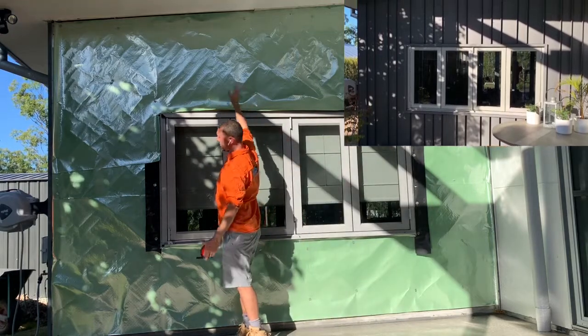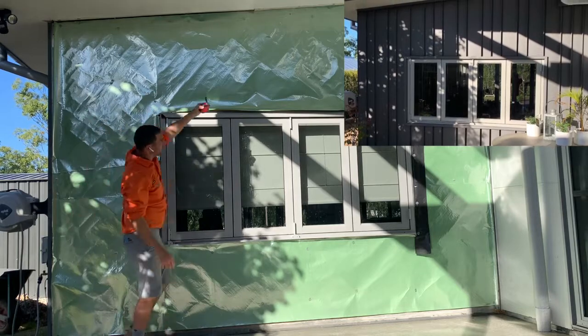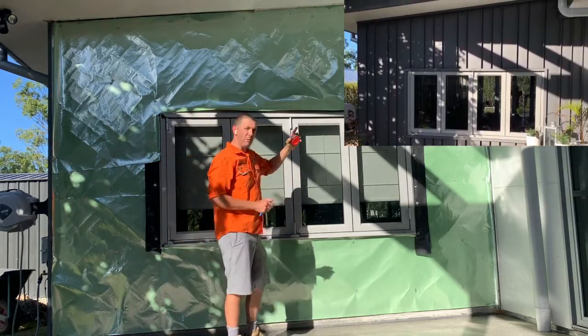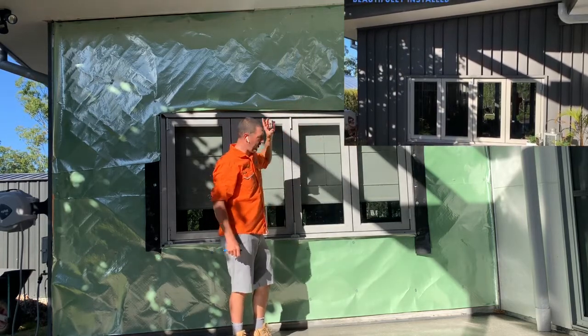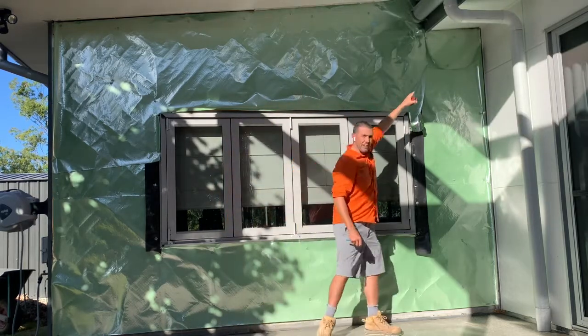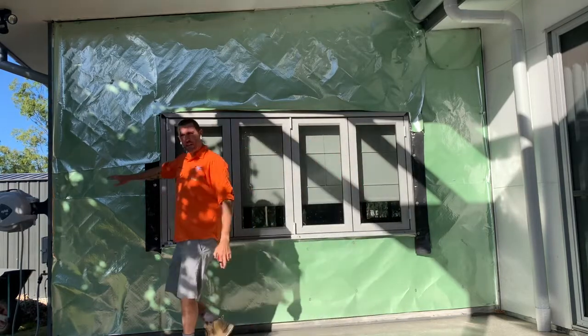We're going to put some sheeting in across the top, and we're going to have a flashing that sits at the top, which is going to receive all of the sheets that we put in, because we don't want fixings, ugly screws and rivets, if we don't need them. So we'll have a flashing up the top that'll come around all of that, a flashing that's going to run down the side here and look really pretty, and one that's going to come over here.